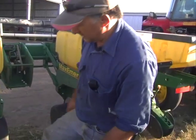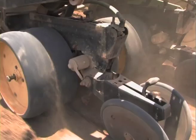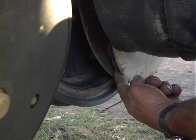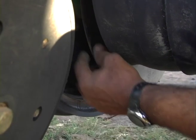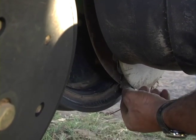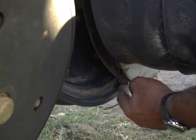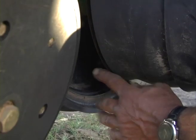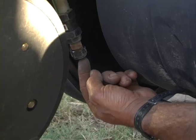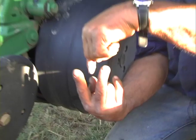There are double depth gauge wheels here so that in soft ground we can get better flotation and a more even traverse across the ground. The seed falls down this chute here. The trench is open at that stage because you've got two discs turning around to open the trench. There's a little steel guide that wipes the trench to keep any debris out. The water injection is actually shooting straight into the trench — it's a single stream coming out here and will fall straight into the trench.